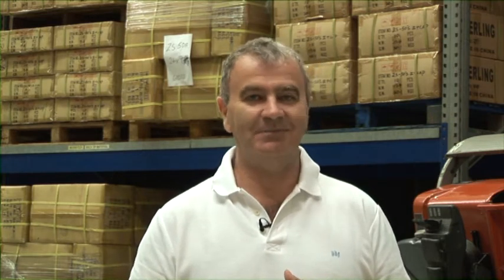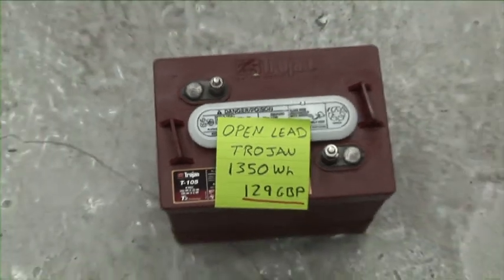So for hard use you've got to use six-volt traction batteries. Join two six-volts together to give you 12 volt, and simply build your battery bank up to whatever size you require. You will be looking at these batteries, assuming you charge them correctly, in 10 years' time.